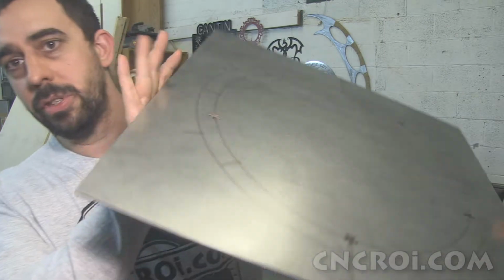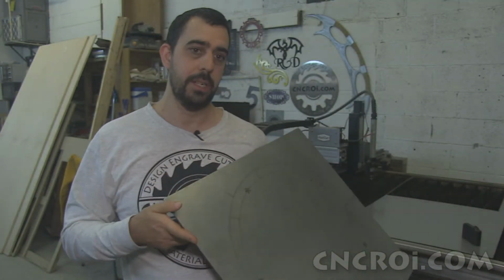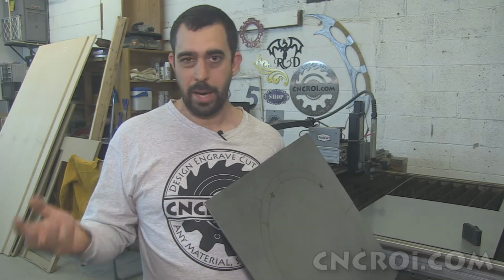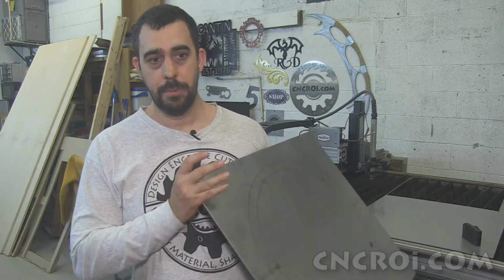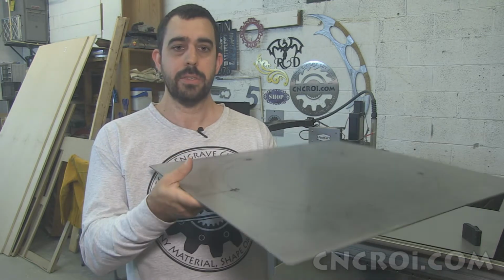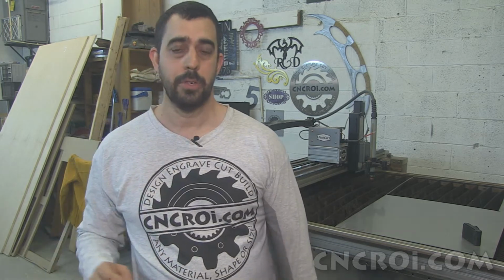The material being used here is 304 stainless steel. And the advantage of stainless steel is that it's not affected by heat. It won't peel, crack, or fade, anything like that over time, just the steel itself. It's really corrosion resistant. It's relatively heavy, so it's not something that will fall down on the floor accidentally because you've got some wind coming through the door or something like that. And the nice thing about it is that we cut it here in the shop using our plasma cutter.